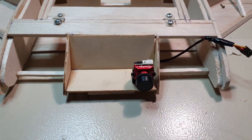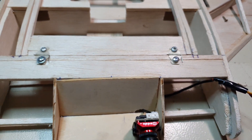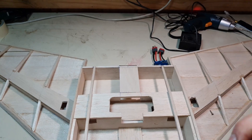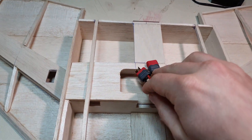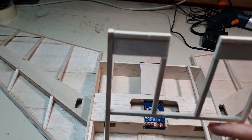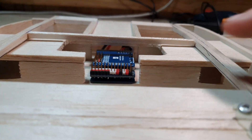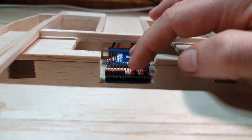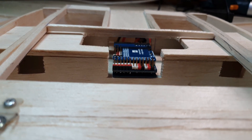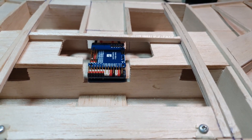Since the last video I've installed the FPV camera and I've just drilled a little hole here to fit the cable through. I've looked into where I'm going to put the main bit of the flight controller and that's going to have to fit in here. It does make it a little bit difficult because it's now too tall, so when you put the cables in it sits too high and will run everything a bit too high. What I'm going to do is just drop the flight controller by about two and a half to four millimeters, and then it will be in where it needs to be. But first I have to remove the hatch.